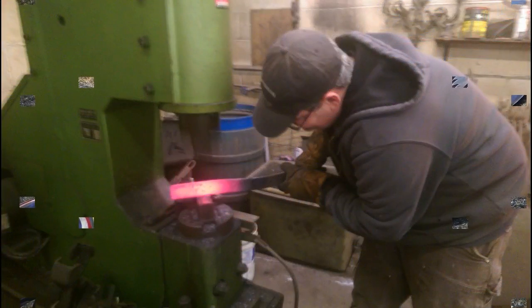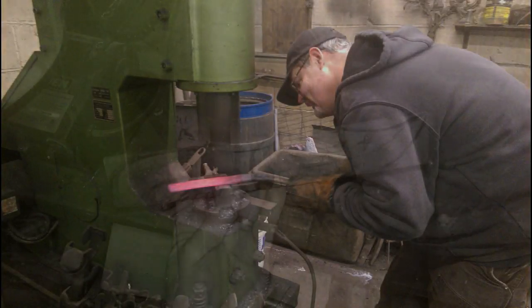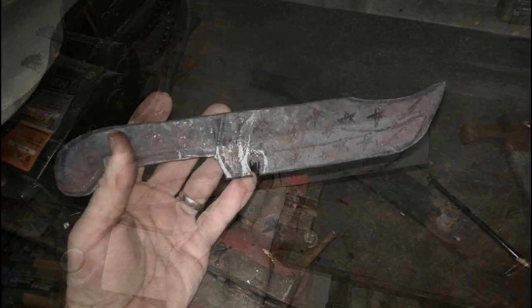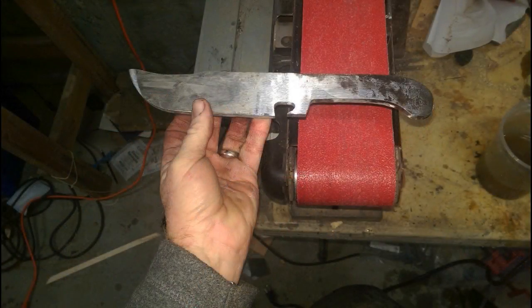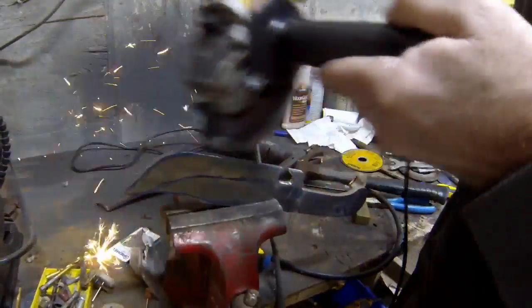I started by running over to my friend Jason Northgard's metal shop. He heated up that spring steel, flattened it for me, and basically annealed it. We let it cool slowly, and that gets rid of the hardness and allows you to work with it without ruining all of your grinding wheels. I'm not going to show you the whole process of cutting out the outline of this knife — it's basically exactly the same as the last knife I did. I cut out the whole outline with a disc grinder with a cut-off wheel, then used a flap sanding wheel to smooth out all of the rough edges and bring it into the final shape.